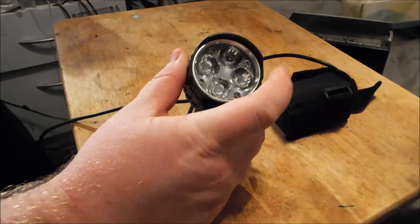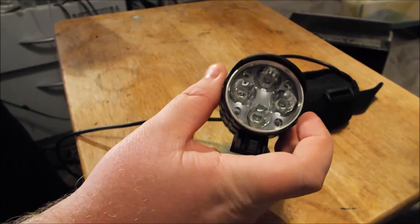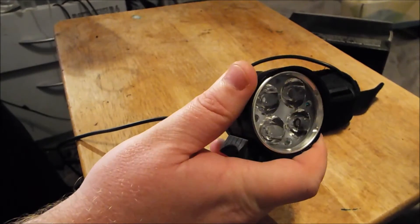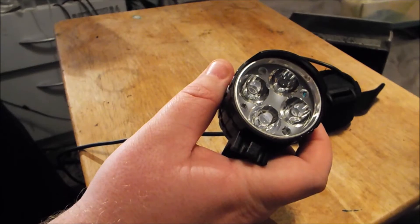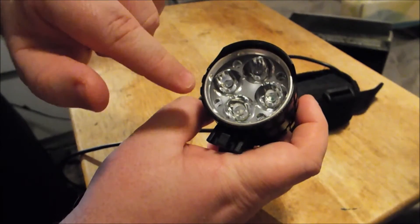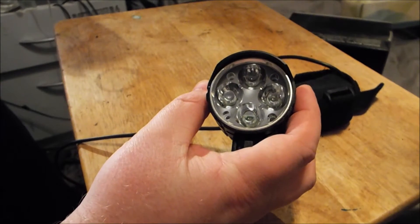Manufacturer claimed: I don't think it's actually 3,000 lumens, and now that I've de-domed it, it's a lot less anyway. Medium mode is claimed at 1,500 lumens, low mode is 300 lumens, and strobe is at 3,000 lumens. Realistically I'd say maybe 1,800 to 2,000, if even that. It doesn't get hot, and after de-doming there's no back shelf between the LED and the housing — it sits on an aluminium MCPCB, so the heat dissipation isn't actually that great. I'm guessing SolarStorm didn't crank up the amps like they could have.